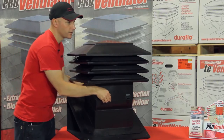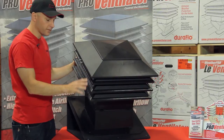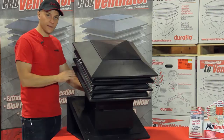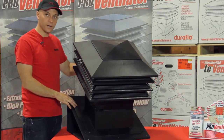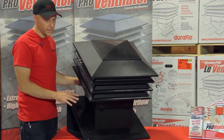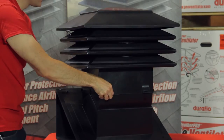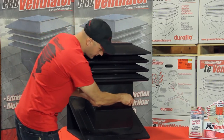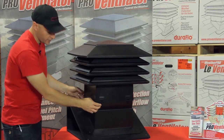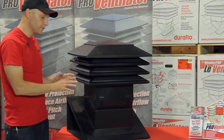You can put it on the roof as is and do your shingle work. What you'll want to do is rotate it forward — all the way toward the eave side of the roof. Shingle up around the sides and around the top. Having it this way allows you to get your nail gun and roofing hammer and do the shingle work without any obstructions. Once you're done, it's really easy to set the pitch. You rotate it back and there are two tabs that allow you to finely adjust to the roof pitch you want, with multiple pitch stops to hold it in position.